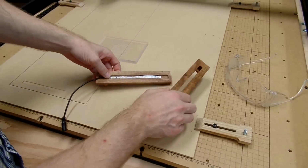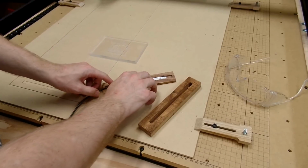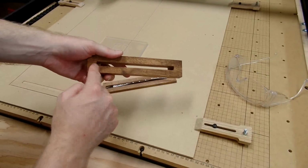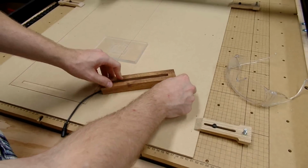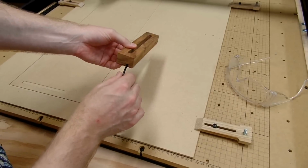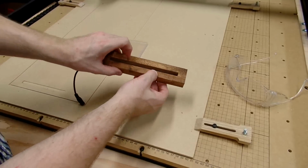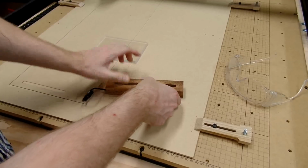So now we've got the LEDs in there, and there's a 3M double-sided tape strip on the back of the LEDs. We'll be able to stick them in there really easily. Then this is the slot that has the 2 little shelves for the acrylic to sit on, and we'll glue the bottom of that right onto that. So this is where we cut it off before, and it'll just glue right back onto that. And then what we'll have on this side is just a power cord that comes right out, and the adapter that came with this light strip kit plugs right into that. So we'll have the LEDs down in there, but they will have this shelf above so the acrylic doesn't actually touch the LEDs when they're in there.